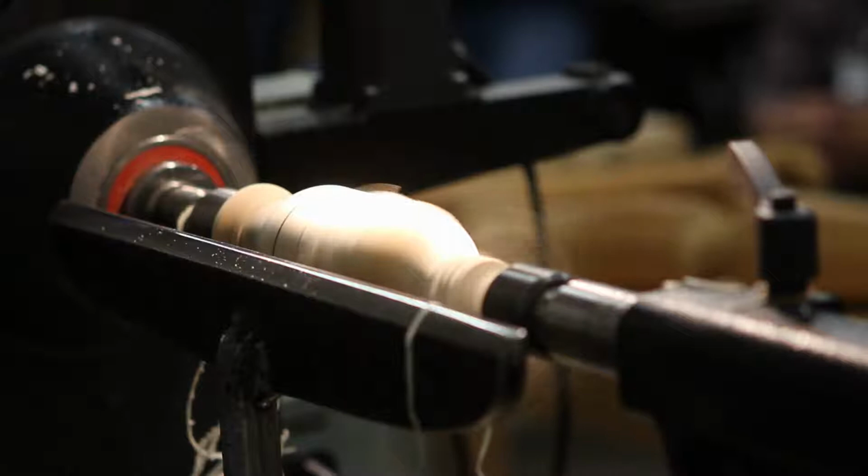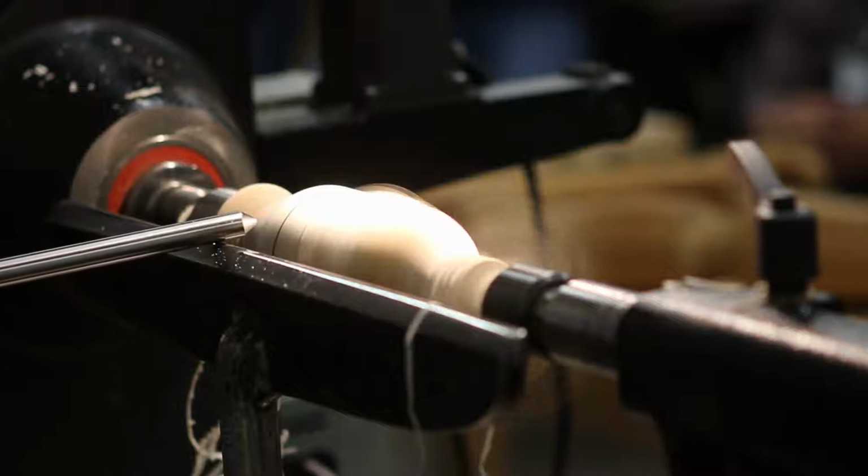Now, a circle, as you may know, is a geometric object that lies in a plane. So a cutting circle is really defining a plane, and that plane is perpendicular to the axis of the workpiece. Right? So in order for the edge to be tangent to the cutting circle, the part of the edge that touches the circle has to be exactly vertical.